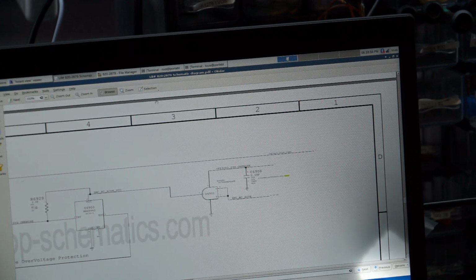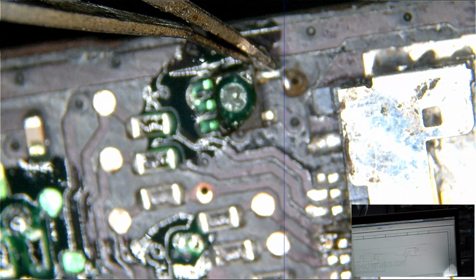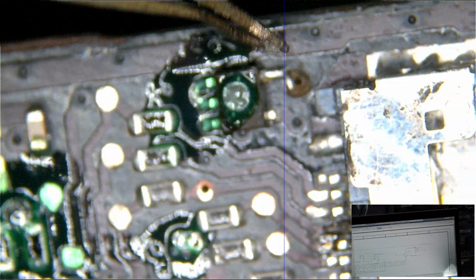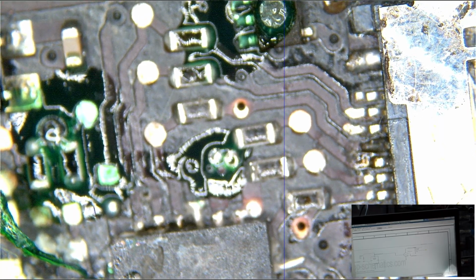By the way, if you don't have 3.42 volts at the chip, because that's a very common fault, let me show you that thing right over here. This chip over here needs 3.42 volts in this pin. This other thing right over here, again, I don't even know what this thing is for, I don't care, has 3.42 volts over there. So you can just run one wire from here to here, and you fix the circuit. And 90% of the time that's the problem, which is why Apple engineers call that the one-wire circuit. I'm confident that all the engineers at Apple call that the one-wire circuit because you can always fix it with one wire.